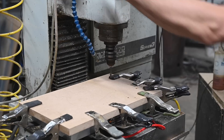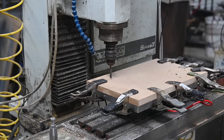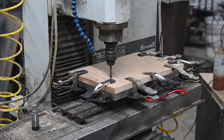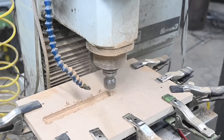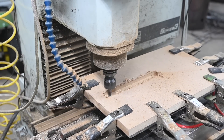The next layer down in this sandwich of MDF pieces is a second layer which will have the air tube running through it. I drilled the quarter-twenty mounting holes along with a pocket for the air tube. After that, more mounting holes for the third piece of the sandwich, which is the base.